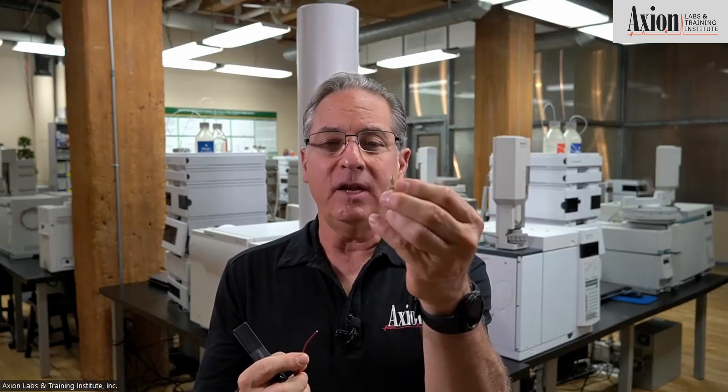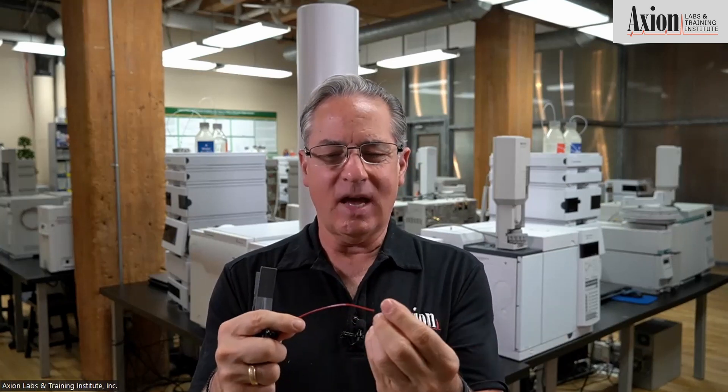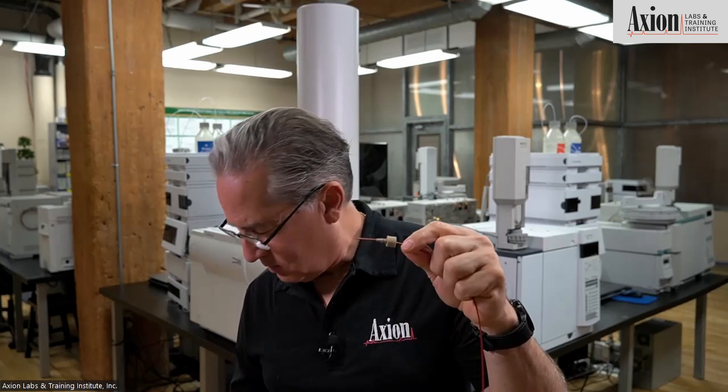So step two: how do you make a perfect fitting? This is how to make a perfect fitting in HPLC — I don't care what kind of column you have. I'm going to show you using a PEEK fitting. The key here is that since the ferrule is made out of plastic, there are no steel barbs to stick into the tubing and it won't permanently set on tubing. That means I can use the same fitting to put into an Agilent column, a Phenomenex column, or a Waters column, and I don't have to worry about whether it's the correct ferrule depth.